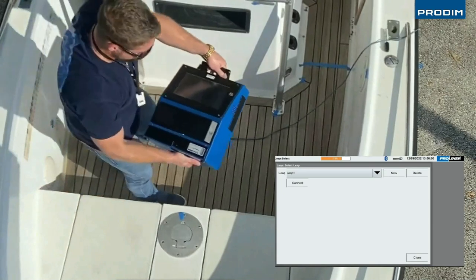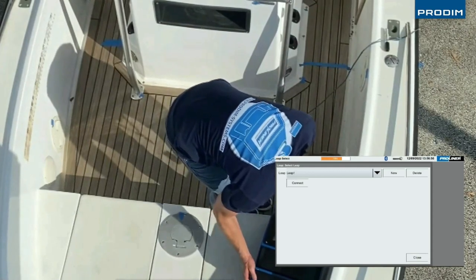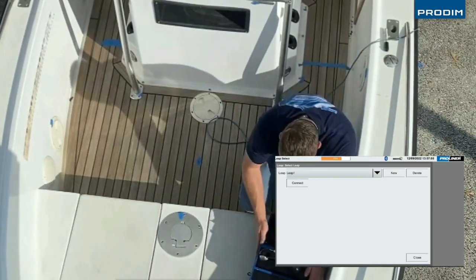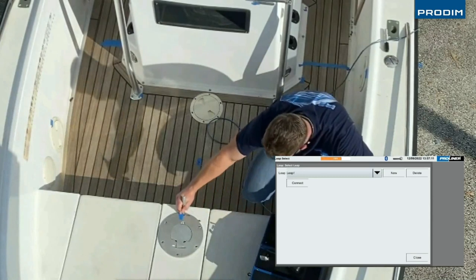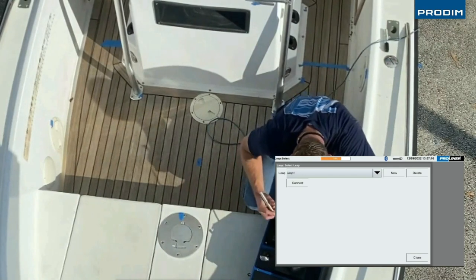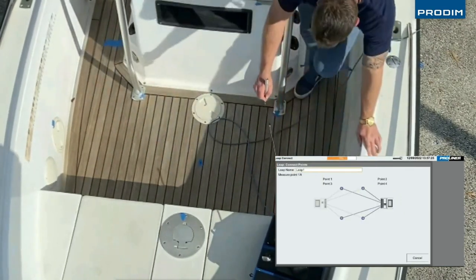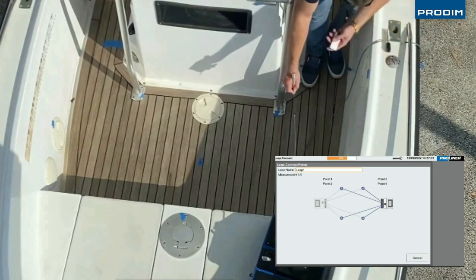Move the Proliner to a new position. And before you start to connect the leap function, check if you can reach the 4 points, and of course the next part of your measurement. You check before you start. Turn the head around and good to go again. It doesn't matter if you do 1, 2, 3, 4 again, you can also hit point 2, 3, 4 and 1.